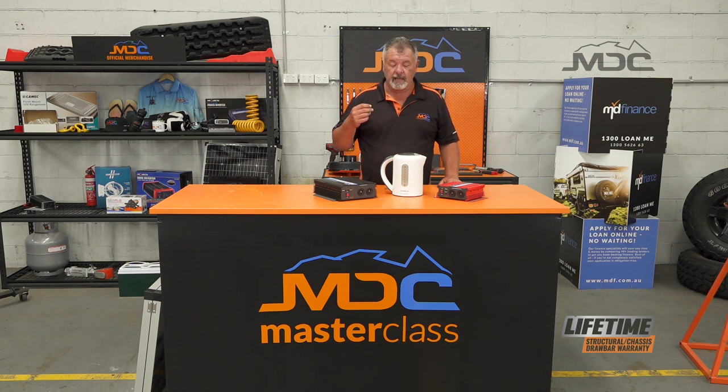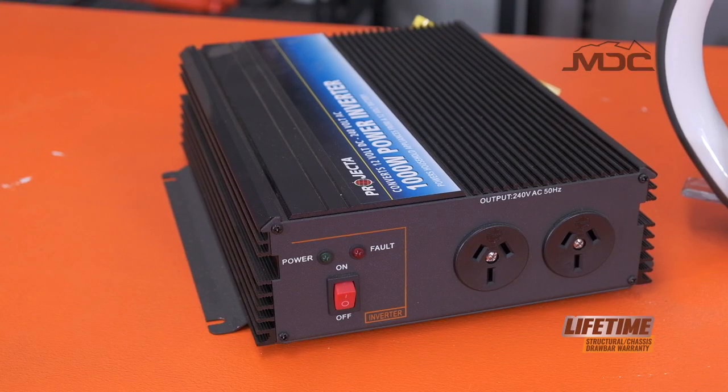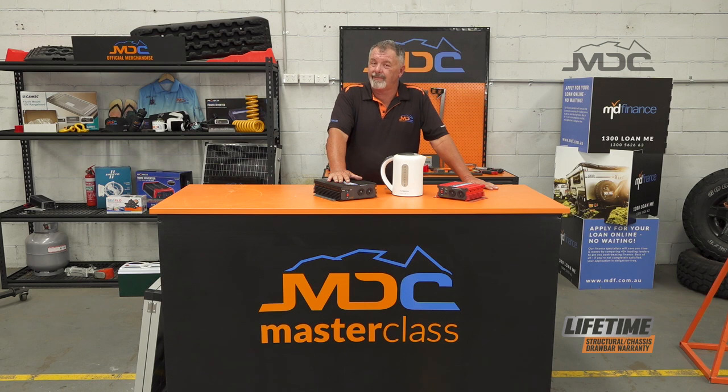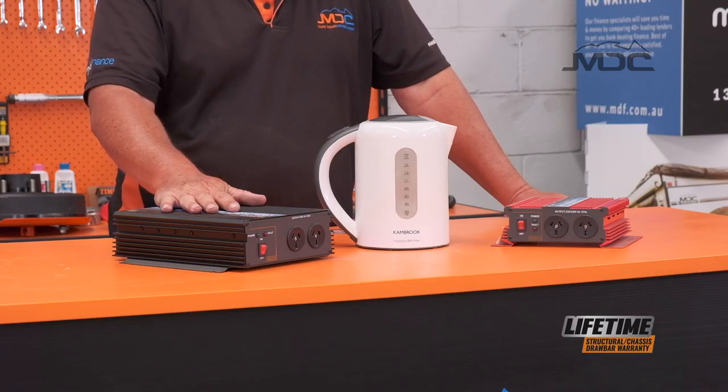Now we need to look at the wattage of the items that we're going to plug into this. This one here is a 1,000-watt inverter. You may think, oh great, I can run a 750-watt microwave from this power supply. Well, you'd be very, very wrong. A 750-watt microwave may actually have an input wattage of something like 1,800, 2,000, possibly over 2,000 watts input into the microwave to produce that 750 watts of cooking power, which means a 2,000-watt inverter is not going to do it, let alone a 1,000-watt inverter.